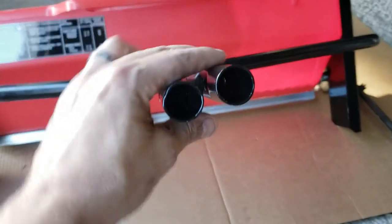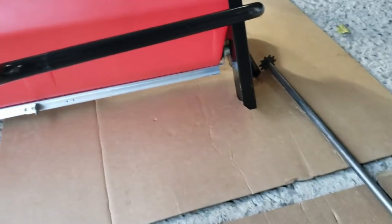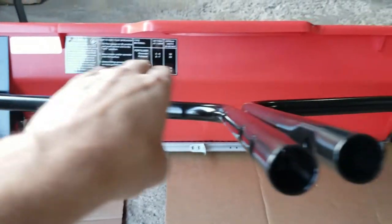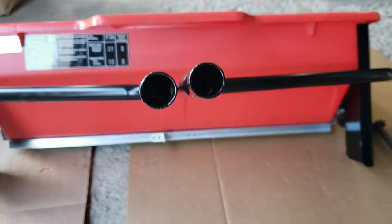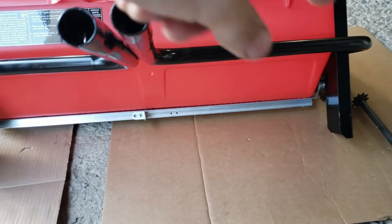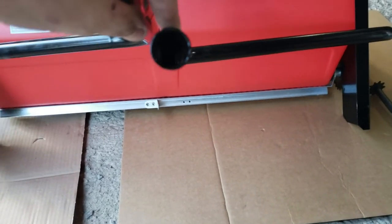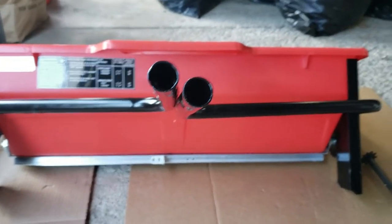All right, next step is putting this hitch piece together and squeezing it together with these three bolts and nuts, which is why I did not tighten those sides yet, because then it'll let me square this up so that it's level across there when we tighten everything down. Because if I had cranked the sides down, this would have been all cattywampus and could have been like this or whatever. So let's do that next.